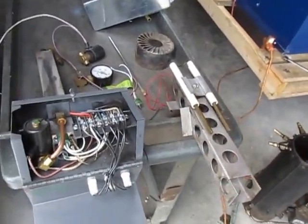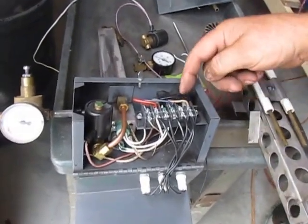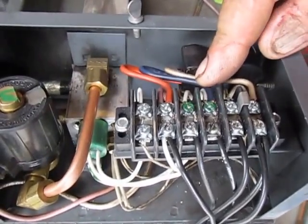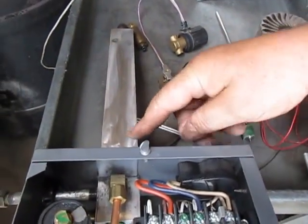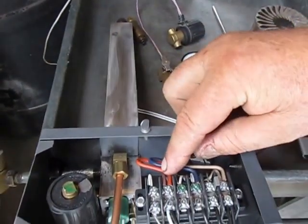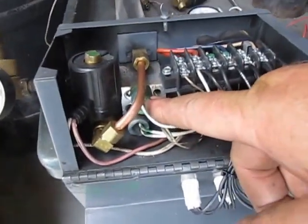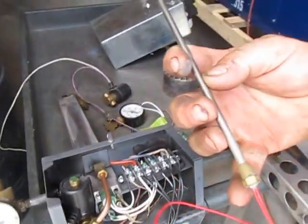The components on the slide-out: the terminal strip — the white one is neutral, the blue one is the idle circuit that keeps the oil preheater warm all winter long, waiting for a flame command from the orange run circuit. That runs the 160-degree upper thermostat, which goes to the big heater with the 7/16 hex in the back.